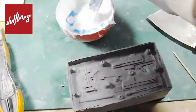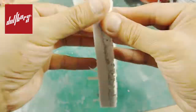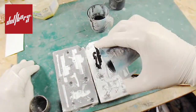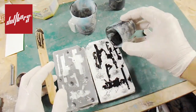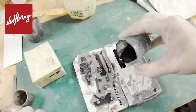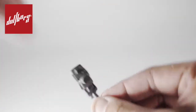The next day our mold will be ready to be cast with resin. Polyurethane resin normally mixes in a one-to-one ratio for its two components. We first pour and use a toothpick to make sure that every detail gets covered in the first half of the mold. We let it dry and repeat the process in the second half. As the resin nears its hardened state, we place the first half over the mold to obtain complete pieces.